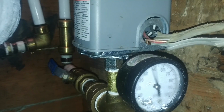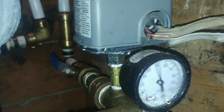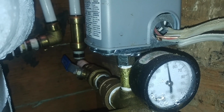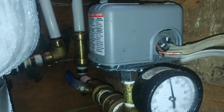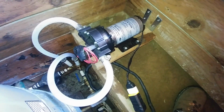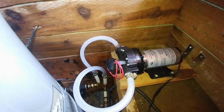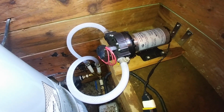and you have a Square D switch that will stop that, in conjunction with your pressure tank. I've got a Square D, and it will turn off at 50 psi, and when the pressure of the house drops to 30 psi, it'll turn back on. What I mean by turn off and on is it turns the cistern pump on, and the pump will kick on and fill the pressure tank, expanding that bladder up to 50 psi, which basically maintains the home water pressure.